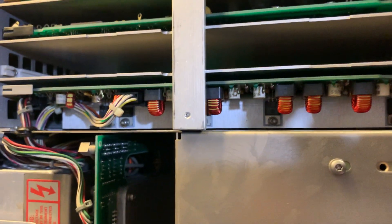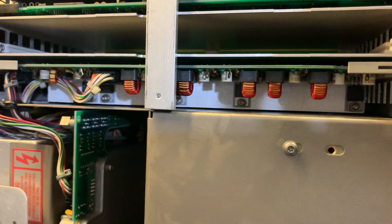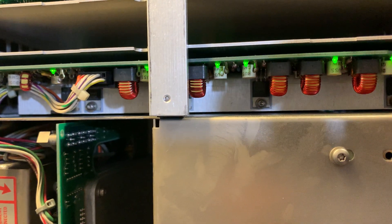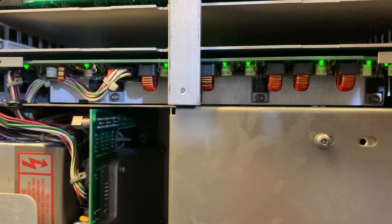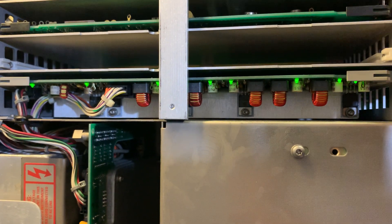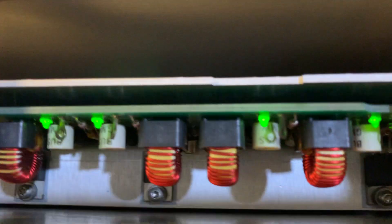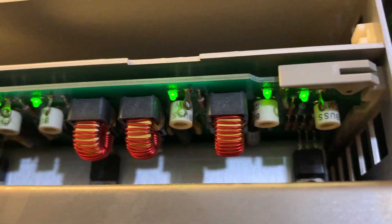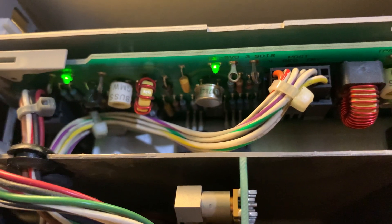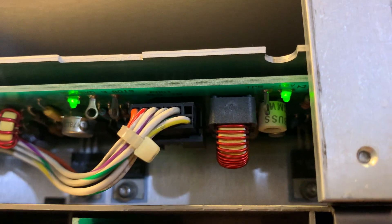To the right of the GSP module is the actual regulator board. This board receives voltages from the pre-regulator and turns them into the voltages needed by the different modules. You can see an array of LEDs that light up when the unit is turned on — basically for a quick visual check to make sure all voltages are present. There's also an array of little ceramic fuses that can be changed fairly easily if a voltage should go out; that would be the first thing to check.